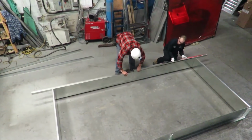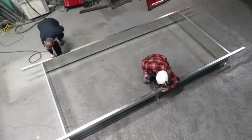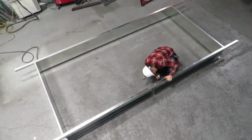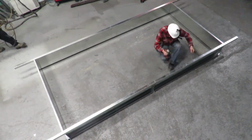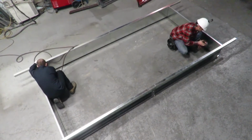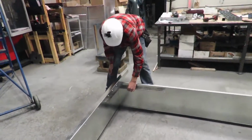The holes on the top side of the channel supports will align with the holes of the curb supports. Ensure that you place the female side of the second channel on top of the male. Use your drift pin to ensure that these holes are aligned. Using the non-rubberized self-tapping screw supplied, fasten the channels to the side of the throat. After ensuring that all the screw holes on the throat have been filled, take time to square up the corners.